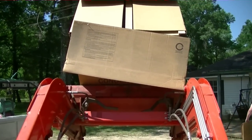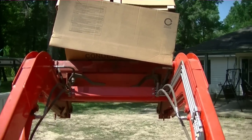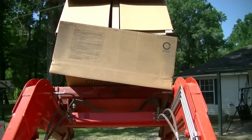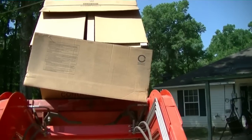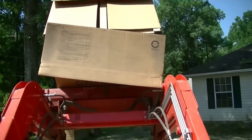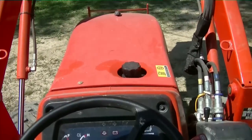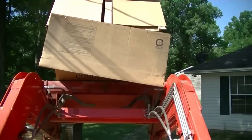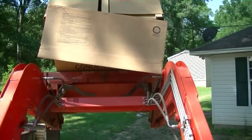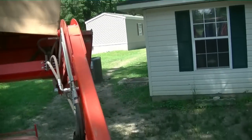There's my condenser and it is a monster. So when you're a redneck and you live out in the woods like I do, this is how you haul a heavy condenser — a five-ton 15 SEER, about 50-something inches tall. Take your tractor, put it in the front end loader, and you just tote her on over to where she's going to sit in place.